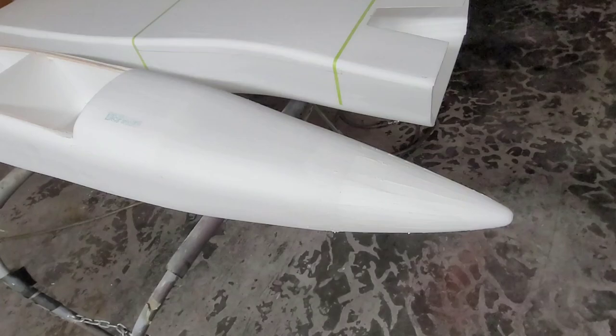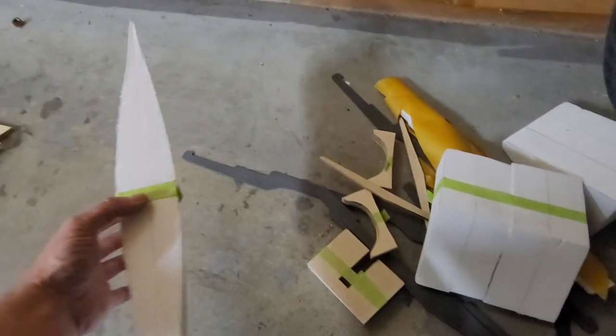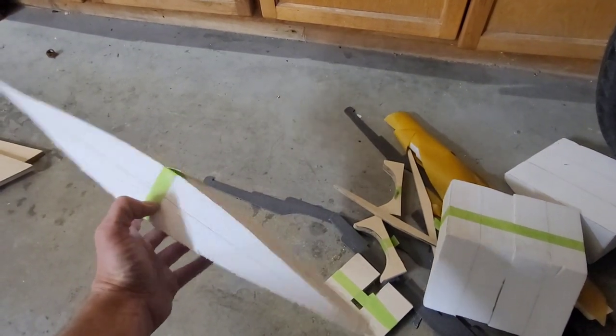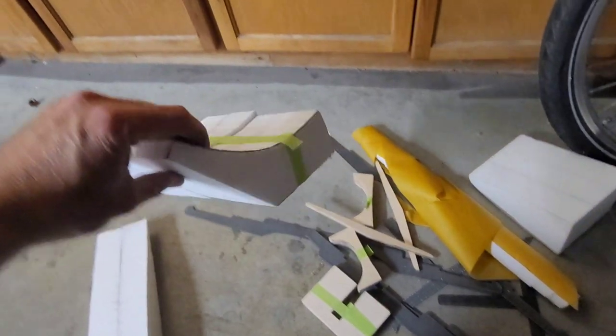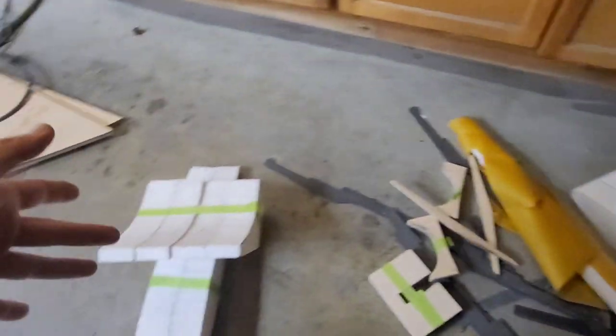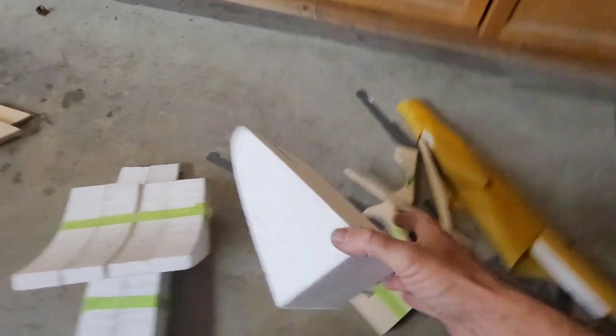I got the nose cone on last night — that's all spackled up. I got a whole bunch of parts over here. These are for the wing roots because you can't hot-wire cut a curved shape like that, so I had to hot-wire cut them straight and I've got to add these on and shape them to match the wings. These are the little fairings that go from the turtle deck to the verticals, and there's two because one side is for Andy. Here's his nose cone.